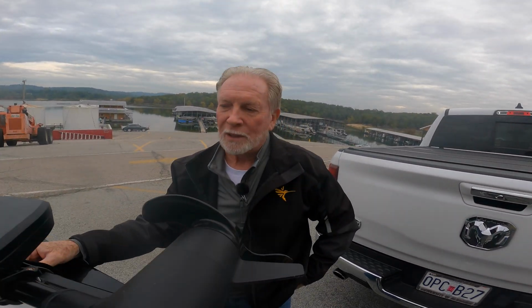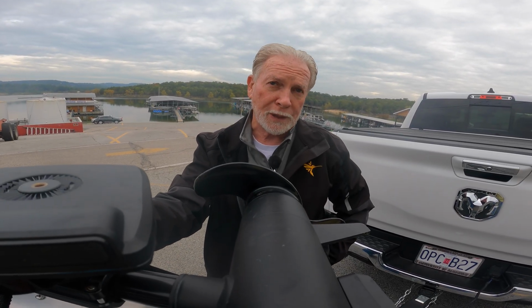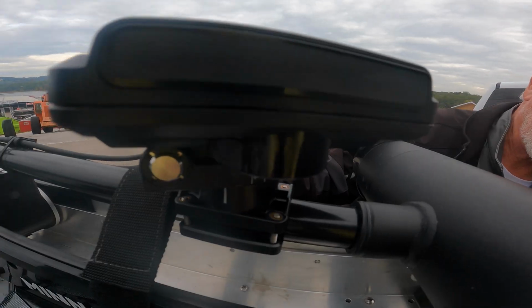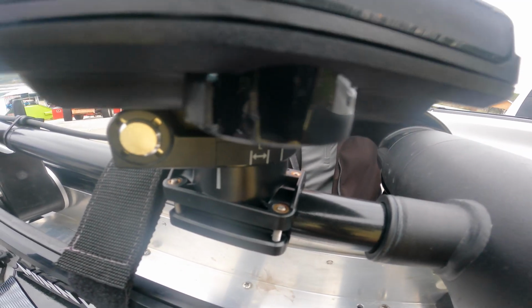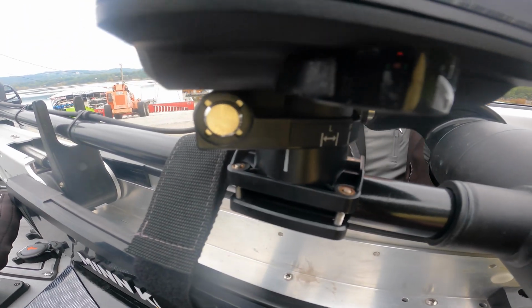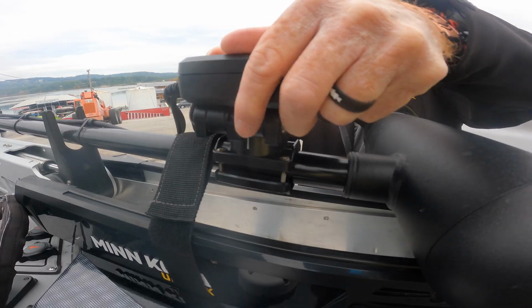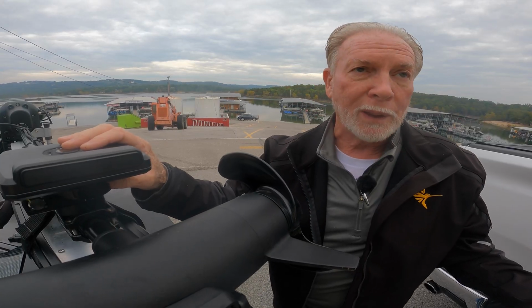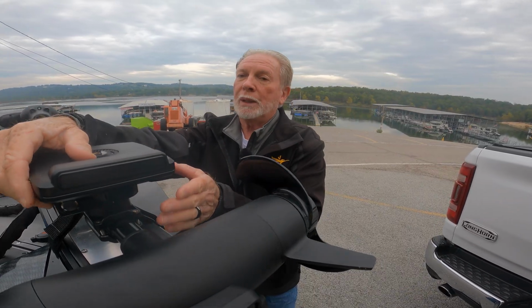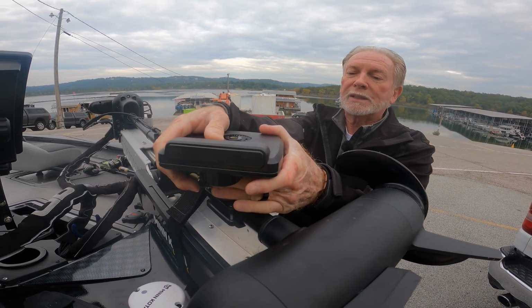Hey Scott, when it's installed on the unit, on the trolling motor itself, our engineers have given you some reference marks on the side here that you can probably see from that side also. It should be mirrored through your forward, landscape and down modes. The easiest thing to do, and the way I typically set mine up from the beginning, is I take the transducer and point it straight down to the shaft of the motor. Then depending on how deep the water is, Table Rock here, we may be 35 to 300 feet, we never know, I will start normally by coming up to the clicks, at about 6 to 7 clicks. 1, 2, 3, 4, 5, 6, 7.